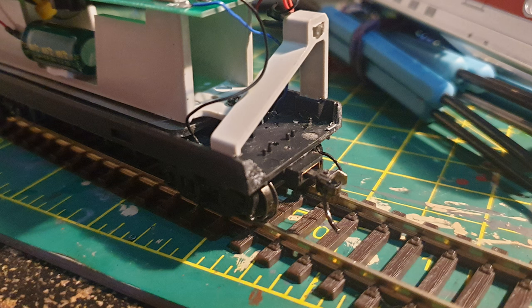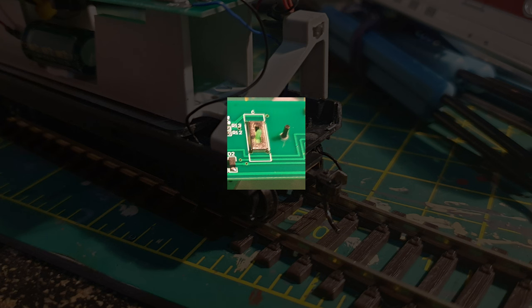Fitting the board and resoldering the wiring was simple. What wasn't simple was getting the shell back on. It turns out the orientation of the frame and the struts holding the board mattered. I am 99% sure it was orientated the wrong way from the factory. Consequently, when I attempted to reapply the shell, it wouldn't completely close, and if I did it the other way around, the volume control would have been inaccessible.